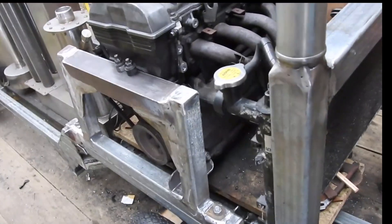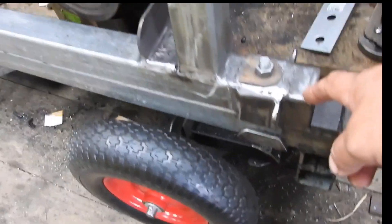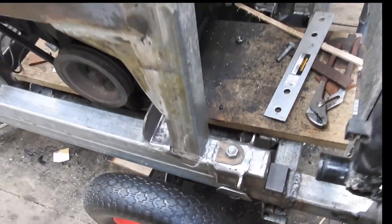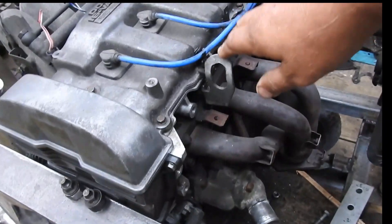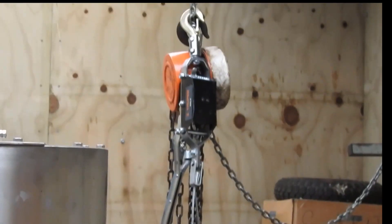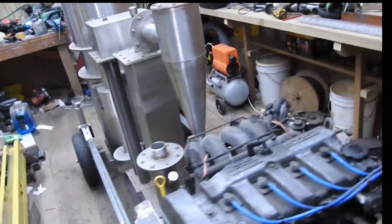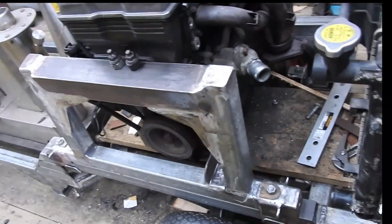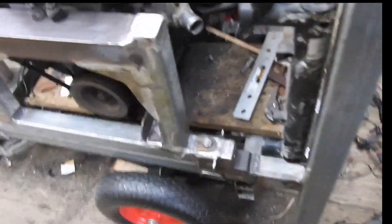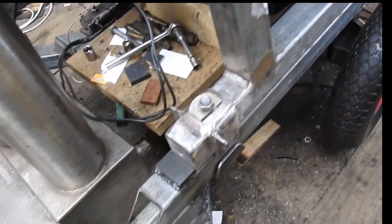At the front of the engine we have another engine mount, once again on an independent rail — undo the bolts and it's free to come away with the engine when it's lifted on its hooks. To do that I have that chain block there, rated at one or one and a half tons, which does very well for shifting and lifting.